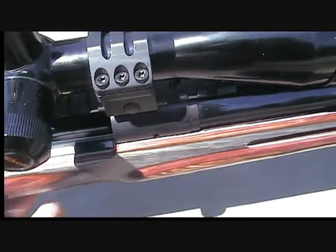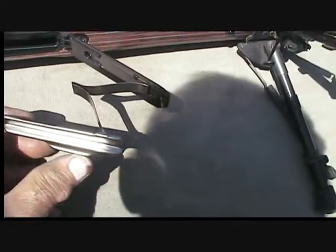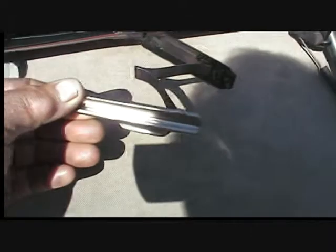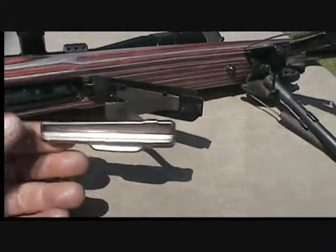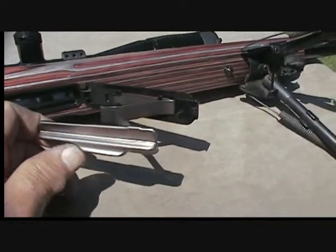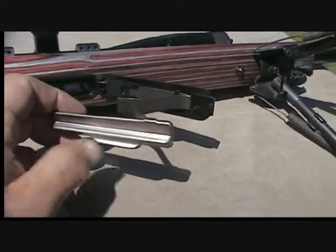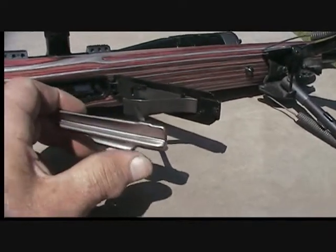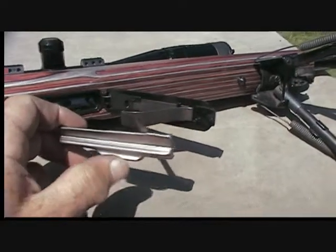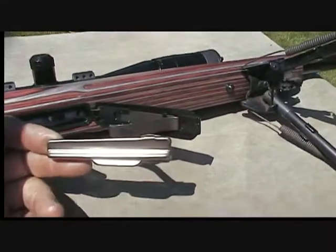The follower on this gun is a little different than your typical Remington 700 follower. This small piece — touching my thumb right here — is what they put on when they make the Ultra Mag and the Lapua. I robbed this one out of a 300 Ultra Mag. I'm in the process of making another one: I took a standard follower and I'm building up this piece, then I'll machine a solid one if it works.